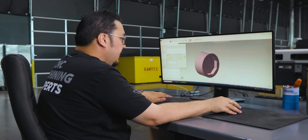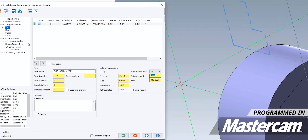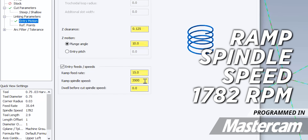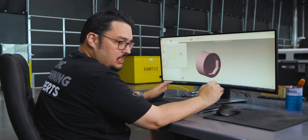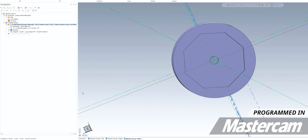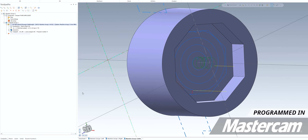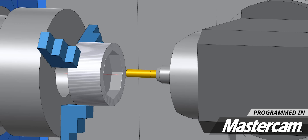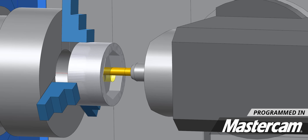I'm going to look back at my RPM — 1782 — and copy that. Under ramp spindle speed, I'm going to paste that in. That should be everything I need, so I'm going to hit OK and generate our toolpath. You can see we have our nice big helical entry at a 10-degree angle, and then once it reaches the bottom depth of one inch, it just starts going to town. If I post this and run the simulator, you can see it's going to do exactly what we want — the tool moving and the C-axis moving.